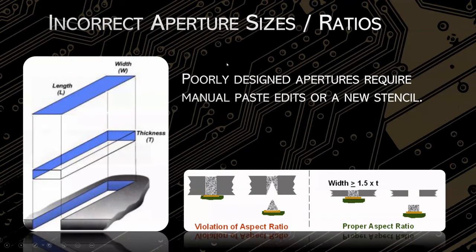Incorrect aperture sizes are a big issue. If you don't have your paste file, your Gerbers, and everything set up correctly, and if it's an inexperienced board house making that stencil, they could create something that's going to cause problems. You can see on the bottom here the violation of the aspect ratio — that stencil is way too thick. What happens is the paste will want to stick to the stencil more than it wants to stick to the board, so you end up with insufficient solder. If you have a lot of really small components, it's very important that you understand the paste process or that your assembly house has a robust way of ordering the right stencil for what you need.